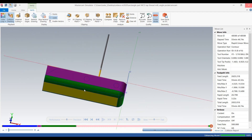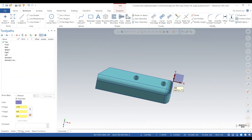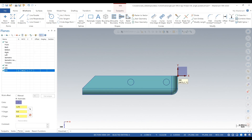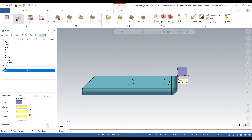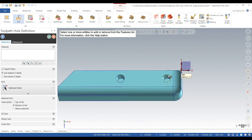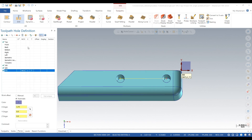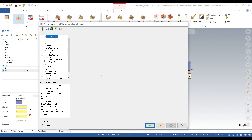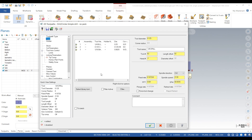Okay, so verify is looking good. Now we'll go to operation 300 and our work coordinate system, and we'll select drill. We'll start off by spotting these two holes — we select that hole and it snaps to the middle, same for the other. Click the check, go to tool, go to select library tool.